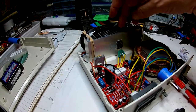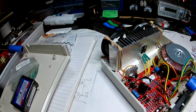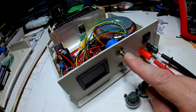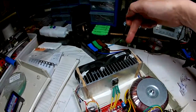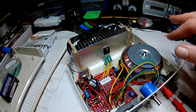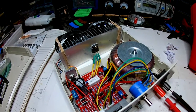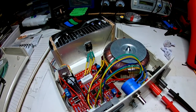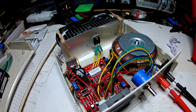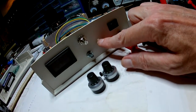The main differences I've done with this are I've got a 10K pot for the voltage control. I've not wired in the switch just yet - it's just coming directly out the back into the transformer. This transformer has got more capability than three amps - they say you should only put a three-amp max transformer on this board, but I think this one can dish out about five amps. I'll probably handle that through fuses, and I've got a switch in the front of this.